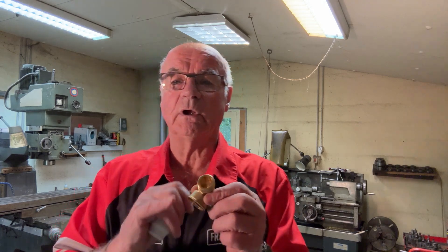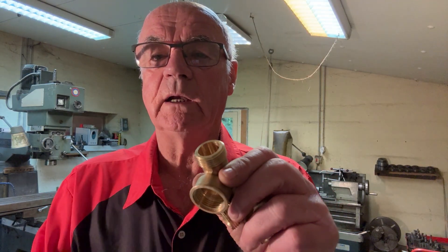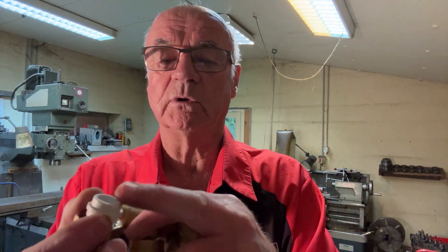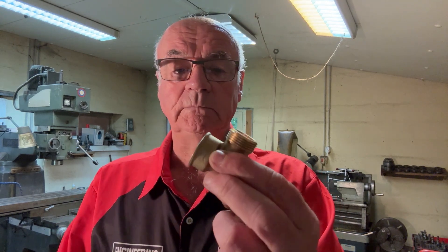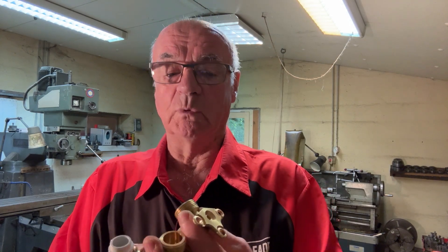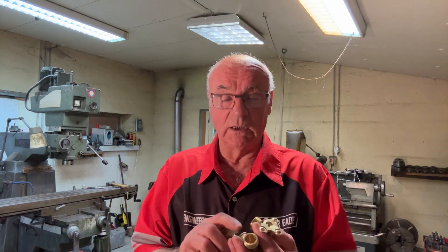Hello again and welcome to my channel. I'm Fraser from Metalworking in France. I've got a little project on today. A gentleman has asked me if I can enlarge the hole in some brass fittings — this hole here that he wants made slightly bigger. It's to take this plastic fitting; as you can see, it does not go. This is approximately 20mm diameter and these are about 18 and a half. I think these are French plumbing fittings. This is what they call a speed fit fitting — I believe it's English. Why people want to bring over English plumbing stuff to work in France when everything else is metric and works on a totally different system, I really don't know. But so be it — this is their choice, not mine.